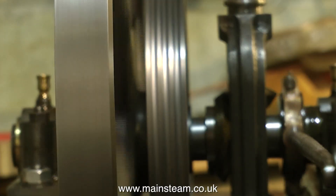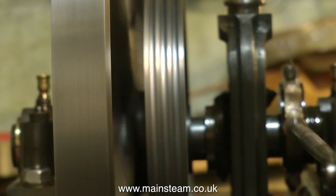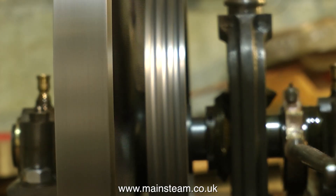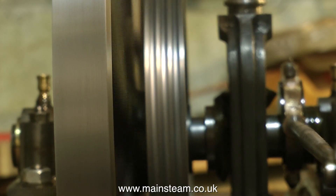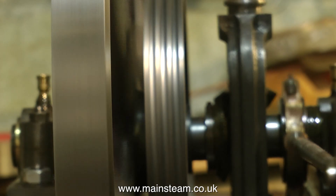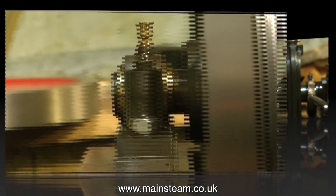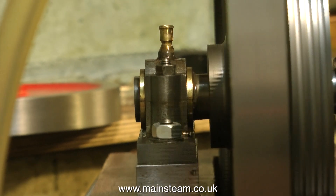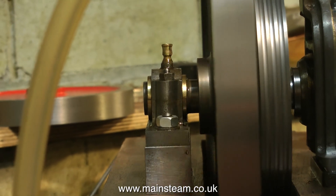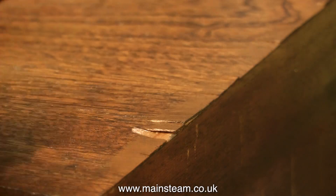Moving to the main flywheel and the small pulley — look at these. Not exactly running true. A quick visual inspection is not enough; I'd really need to have these off the shaft to see what sort of fit they are. The builder has also deviated from the drawing: on the drawing there is a pedestal supporting the outer edge of the flywheel, but instead he's built the whole thing onto a box, and that box is a joke — made from very cheap softwood with a veneer stuck on it that's coming off.